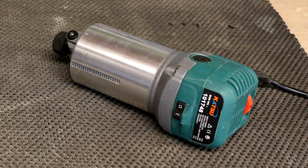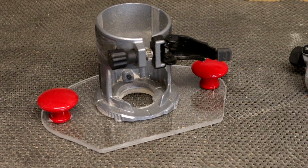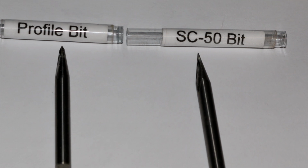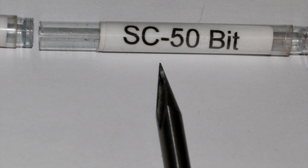I'll be using a 1/4 inch trim router to carve the design. This is a Katsu router, which is really cheap but a brilliant router. I'll leave a link where you can get it in the description. I made a larger base for it, which makes it a lot more stable and easier to control. The bit I'll be using is an SC50 bit. It tapers to a very fine point so I can get some very fine detail into the design. Again, links in the description to where you can get it.